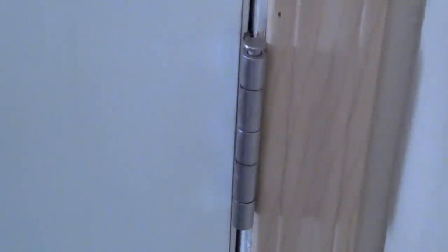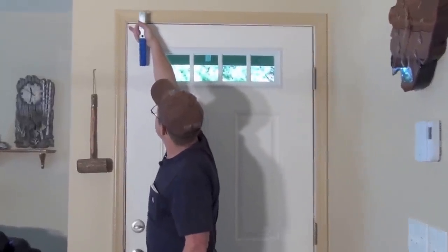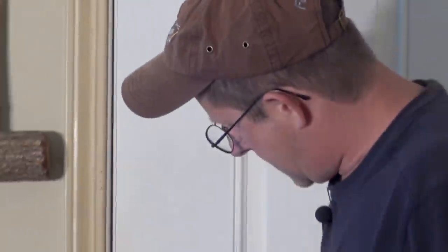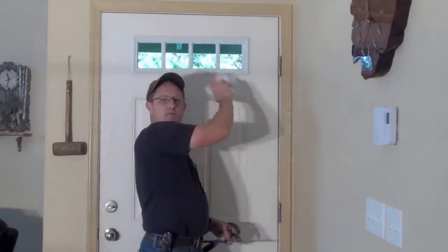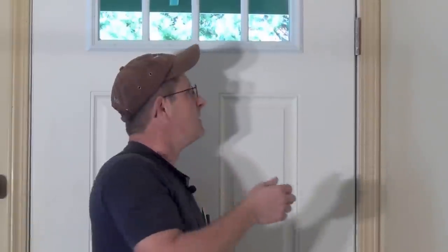We've made our great little tool for fixing hinges and the gaps in doors. You can see how tight it is here against the jamb and the header, and as you come down it gets wider toward the bottom — we're gonna fix that. A lot of times you can open the door, take out a couple of the short screws, put in some three-inch long screws, and that'll suck it over and usually fix it. But sometimes you can't, so we'll fix it with our handy dandy tool.